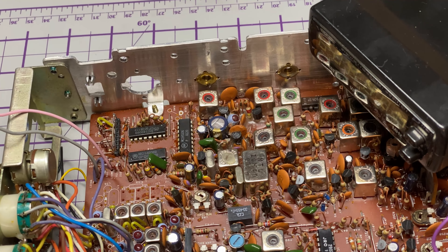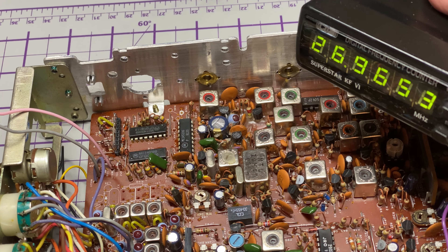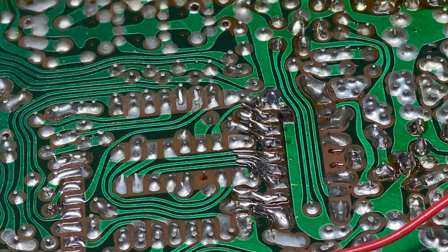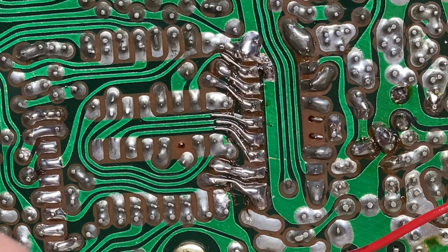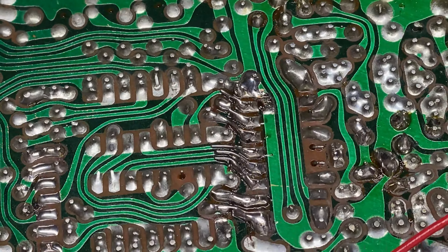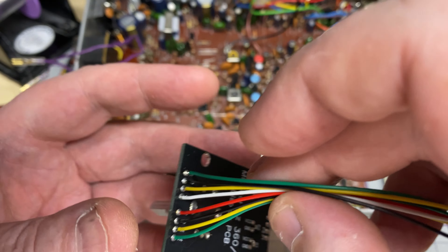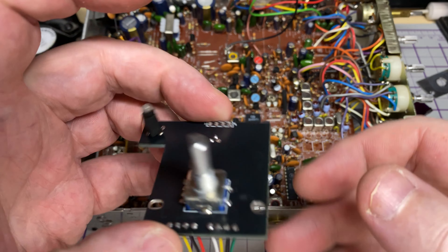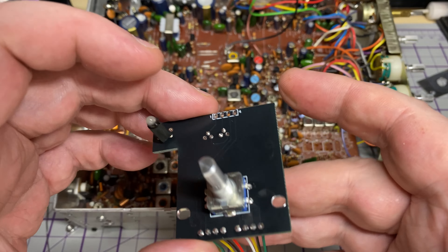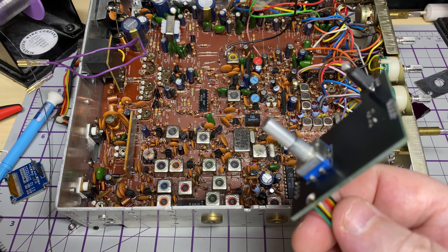I've fitted my channel one header and remade the tracks, which you'll see in a moment. We'll just check it's on channel one mid-band — which is absolutely correct. KC shift still works, so I've managed to restore that. There's the work on the underside of the PLL. Why they didn't take the binary adders out and connect the wires into those points I'll never know, but all the professionals just love cutting tracks. There's the front display PCB with the rotary encoder and the place for the RX and TX LED — no silicon required.